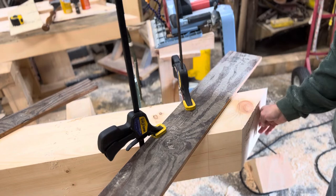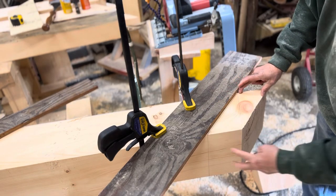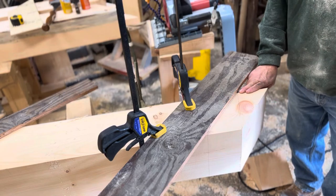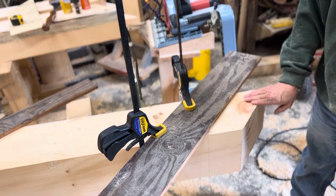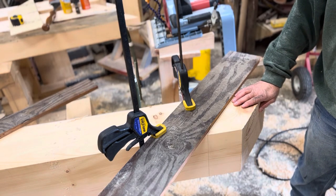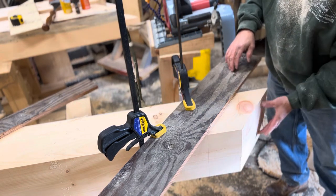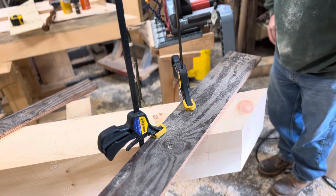So what you saw was a cut coming across here. Now this area is going to be removed — I'll end up marking it here and I'll have a tenon that comes down like this. On this flat side, I'm going to demonstrate something in another upcoming video. Timberdoodle put a little note about doing a drop cut. Generally I discourage drop cuts because this is not at a 90-degree angle and it's coming downhill, where you can lose some control — we'll talk about that and maybe do a demonstration on a drop cut on that rafter.